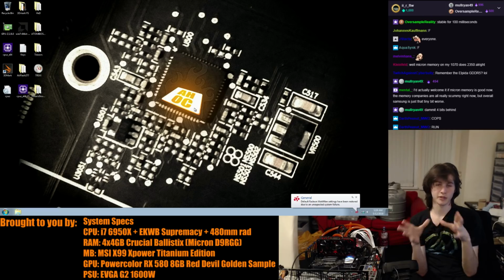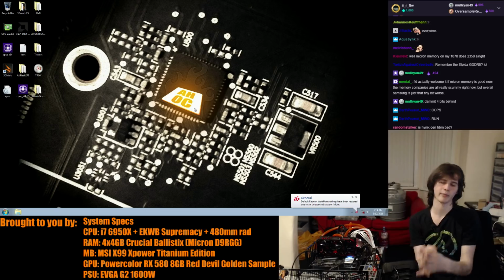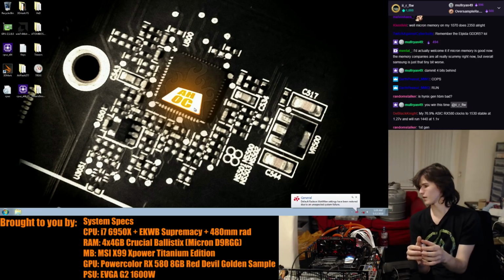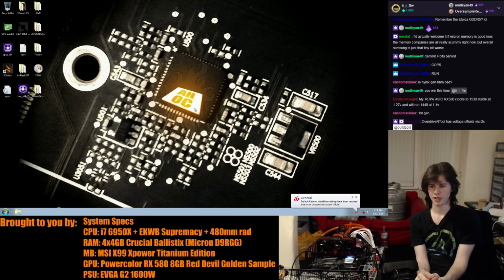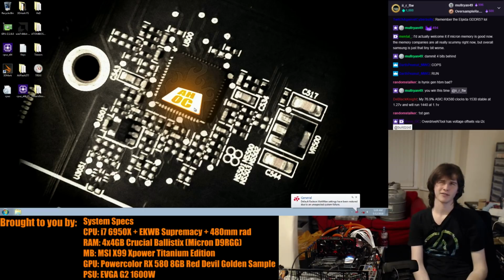Basically you can program anything on the card over I2C, like voltage controllers. And there's a guide for how to set a core voltage offset on basically any card with a 3567B. So I could do that to get the extra core voltage without bypassing Wattman, because it would be an offset set in the BIOS itself. And Wattman, as far as I know, doesn't play with offset voltage. It actually sets the voltage. So I could do that.